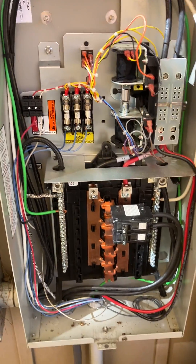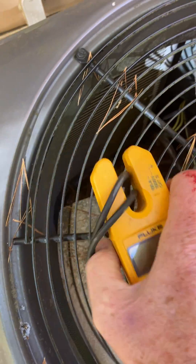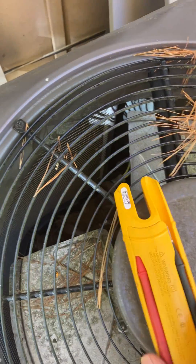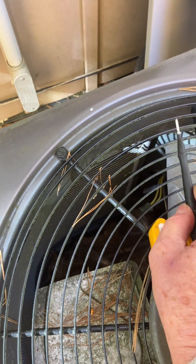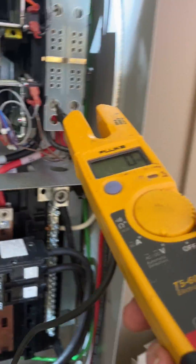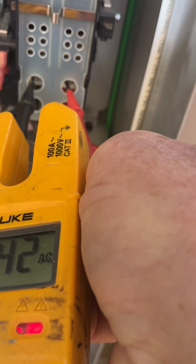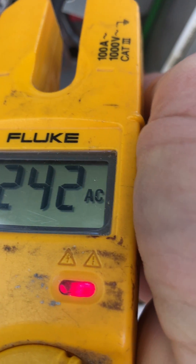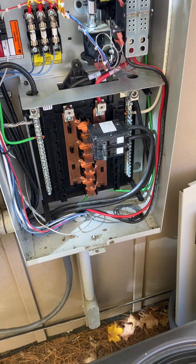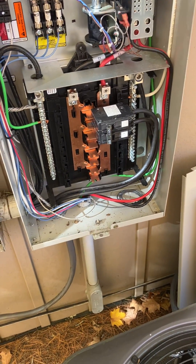Now I want to see if I can set this and operate it — you only have to set it for volts. If it's DC it'll tell you DC, if it's AC it'll tell you AC. The generator output should be right there. The voltage coming out of the generator is good, so it's not only running — it's running at the right RPM and the right voltage. If it stays that way...